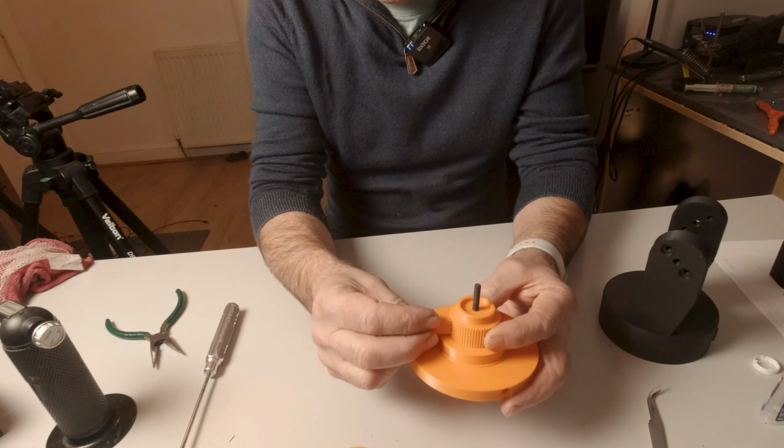Now originally I modelled these to be printed as one piece. Unfortunately, the support material causes the inside faces of these to be very rough, and you're only getting about 50% of the friction you should be inside the joint. So I've gotten rid of that idea, and now we're printing this as 5 parts. Now it takes the same length of time to print, but it produces a much neater job that works more effectively. So these are the 5 components required. And what we have to have ready is a 50mm low profile bolt to go in through the side, and some super glue, okay? And we're going to use this as well to help keep things aligned as we work.